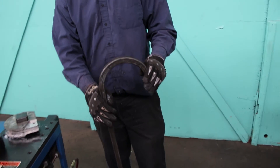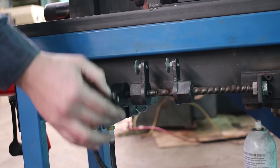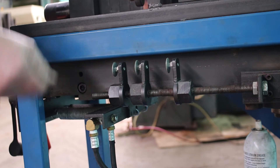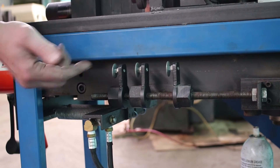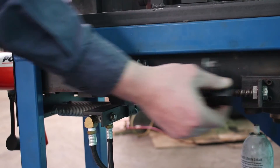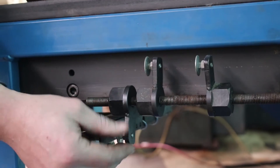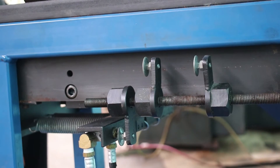So for your gates and farming needs, this is our stop system — this is an air powered stop system that basically trips the machine to stop. So we can use the magnetic tape, or we can also set up a stop system for production runs. We have three stops we can set for common bend sizes and angles — say a 60 degree stop, a 90 degree stop, and a 120. They're very easy to move around and dial in. You've got a fine adjuster here, and as the machine traverses across the rack, the stop system will trigger the switch and shut the machine down when it reaches the desired angle.